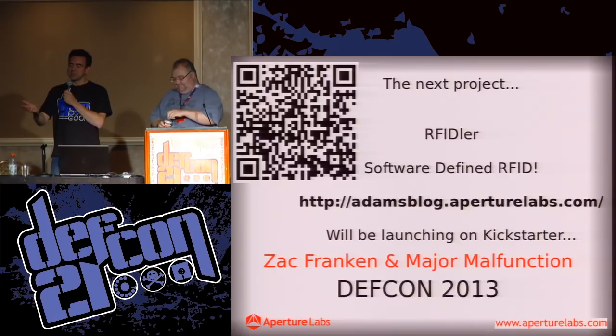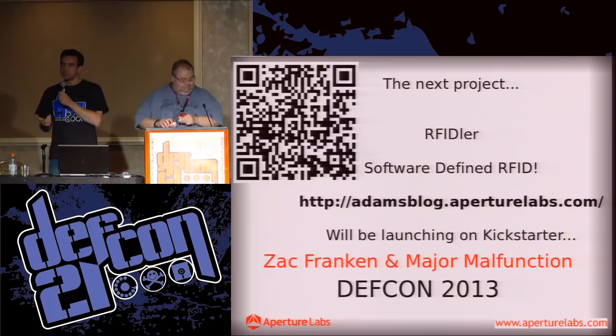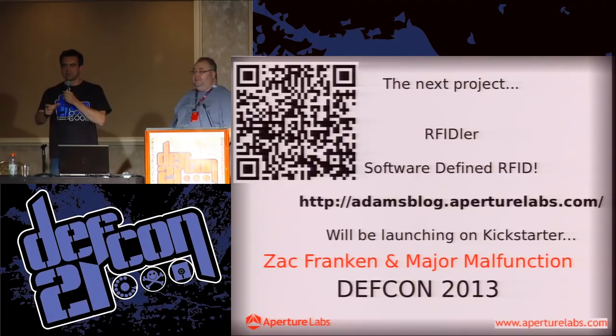The checksum is actually two checksums. The left-hand byte is a left-hand checksum, and the right-hand byte is a right-hand checksum. And they just do a slightly funny wandering algorithm that would definitely go wrong. It's just there as an assurance to make sure that the code that runs on the chip is right. So they'll have a test routine that will run through and read the ROM before they blow the fuse, calculate the checksum, and make sure it matches. So it's not going to try and recover any lost bits. It'll just say yay or nay. Yeah, and the fuse is there only to disable the test routines for the chip.